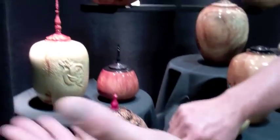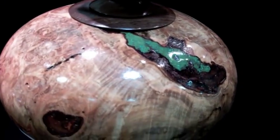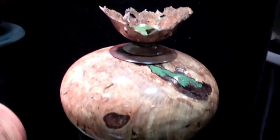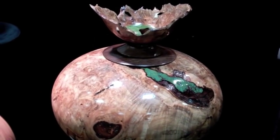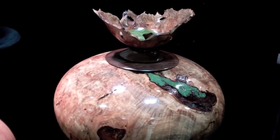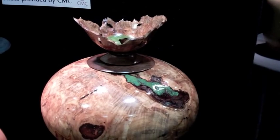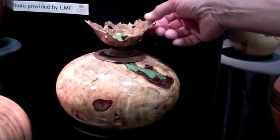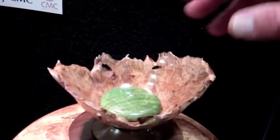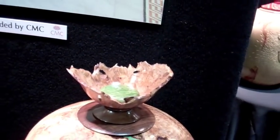We also do all these other wonderful one-of-a-kind art pieces. This urn is an ambrosia maple burl — basically a bark inclusion, which is a softer material. We enhance, embellish, and stabilize it by crushing semi-precious stone, mixing that with epoxy resin, and filling in those voids. The top is a little natural edge bowl with a piece of stabilized maple that actually looks like a little semi-precious gemstone.